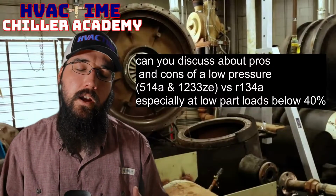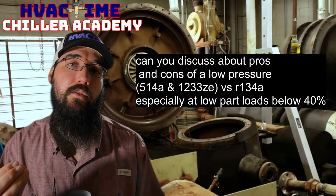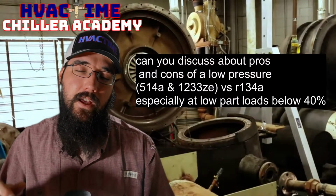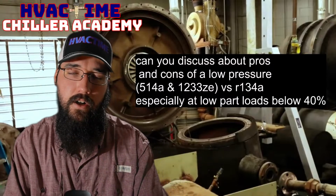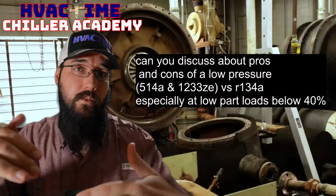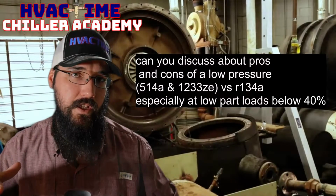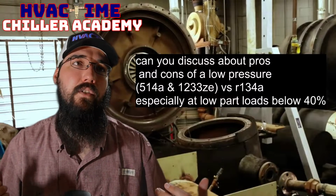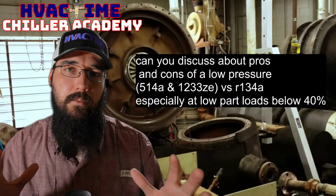And when those get too far apart, that means we're stacking non condensables at a high enough concentration to need a pump out. Another way it's done is we can monitor the suction line temp of the purge compressor. As that temperature drops, that means we have less heat exchange inside of our little evaporator, which means we have a lot of non-condensable stacking. Time for a pump out, right? So those are just some of the ways we have gone about utilizing a purge system.